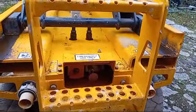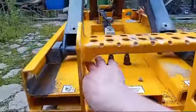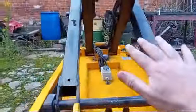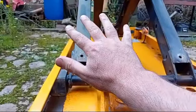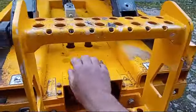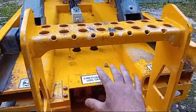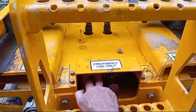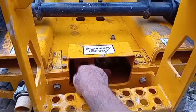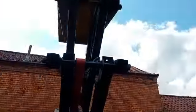The only other thing to explain is there's a very good reason why this is placed where it is, next to the step. This step stops you having your arms anywhere they shouldn't be. By having the emergency controls located through here, it very much reduces your ability to get your arm into the hydraulics and steel components. So pull this, wait for the machine to come down — that's a basic overview of the emergency descent on a modern electric scissor lift.